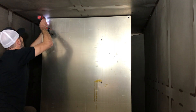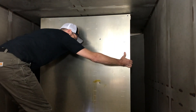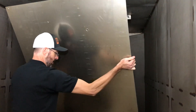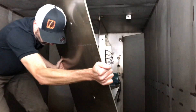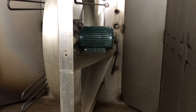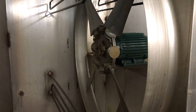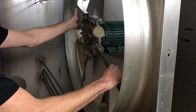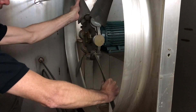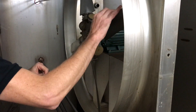Let's get started. This motor is about three years old. It works fine, but we're going to do a little preventative maintenance. To verify that the bearings are still good, check for any play in the shaft. It should also spin free and easy.